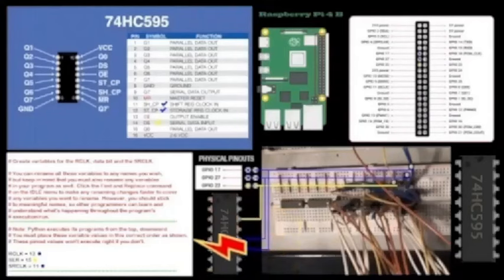Q0 or Q1 all the way down to Q7 — that's your adjacent layout. And the same thing with the shift registers — they're laid out exactly this way. That's your VCC, that's your ground. The shift registers that aren't in use right now — the ones not being driven — can still have power running through them freely without damage, as long as you don't attach any other wires, because it'll affect your bit count.